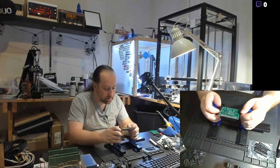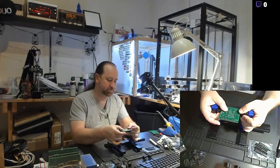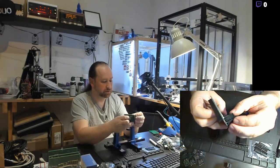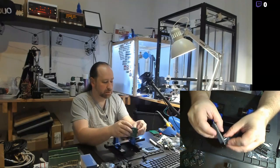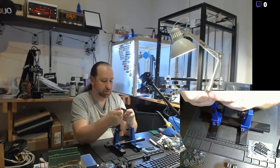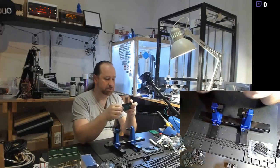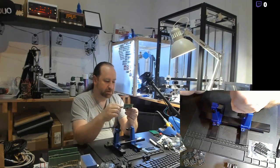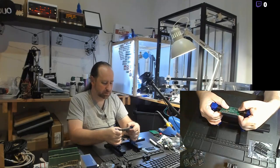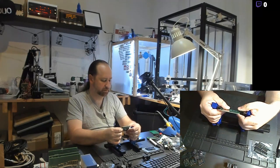All right, and today I am building Raspberry Pi based 1541 Commodore floppy drive emulators. These boards will actually sit on top of a Raspberry Pi 3 and provide an actual serial interface directly to a functioning Commodore. And the Raspberry Pi 3 completely emulates from the ground up all of the BIOS, CPU, everything that's functioning inside the 1541 normal floppy drives. And actually now they've updated it. The emulator also now supports the 1581 drive, which was a larger drive. It used actual 3.5 inch floppies instead of the 5.25 floppies.